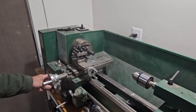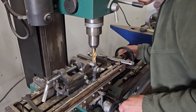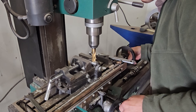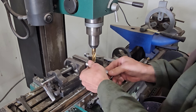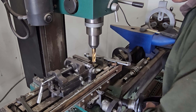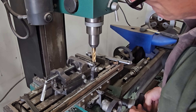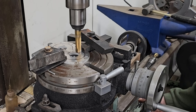To start off, we need to build a bunch of parts before we can assemble this thing. I'm starting off with a couple of parallel shafts. I've used some shafts that are already cut with a keyway in them, rather than buy a shaft and cut the keyway in it. This way, just weld the keyway shut and then machine that back down to its original diameter. The ends have to have a couple of flat surfaces for the steering linkage universal joints — they call this a D connection. Here's a shaft cut and one machined.